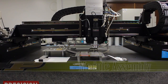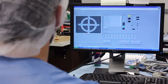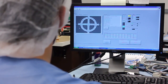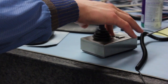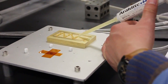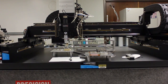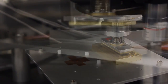The operator places the bare module and HDI onto vacuum chucks on the robotic gantry. Under LabVIEW control and high-magnification optics, the operator locates fiducials on the bare module and HDI and stores their location in memory. The operator fills a reservoir with epoxy, and the rest of the glue stamping is automatic. The robot moves the stamp over the brass reservoir and slowly brings the stamp tool down into the epoxy, which is then transferred to the top surface of the module.